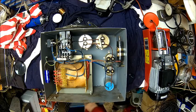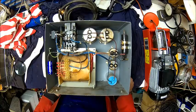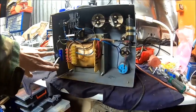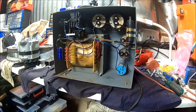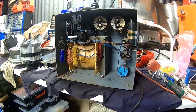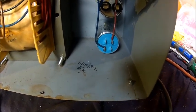So we took the cover off and it's an old-style capacitor design. Unfortunately it doesn't look very healthy. That capacitor here has lost its fluid. It's 47uF, 450V. It's got a birthday which is the 6th of October 1989, made by RK, whoever that is.